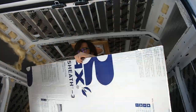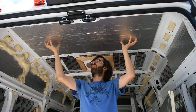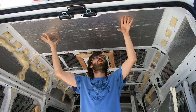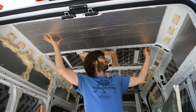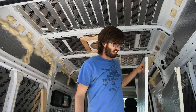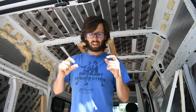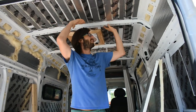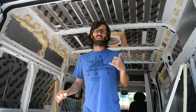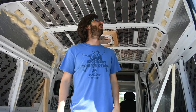It seems like it will work — there's quite a bit of surface area to hold, and our wooden panels will run under here which will hold it up as well once I put a furring strip across. So that'll be a total of about an inch and a half of poly iso board up there, which I think will be pretty good. We're going to lose some headroom, but I've got plenty of space. The ceiling is the place you lose and gain the most heat so it's really important to do a good job there.